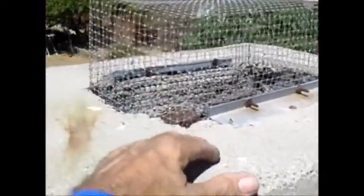I didn't have a chance to talk to the chimney guy, but this spark arrestor is not good. You need a rain cap type of spark arrestor, and the square inches here may have to be more. It's an unlined chimney, and I don't see any cracking on the chimney cap, and your bricks here, mortar, look pretty tight. And seeing that you've had a specialist here, I'm going to refer you to look at his report too.